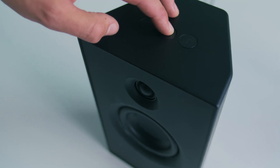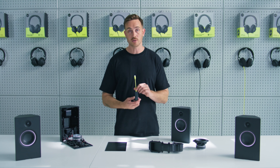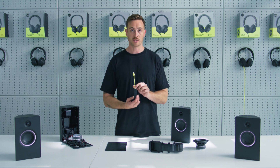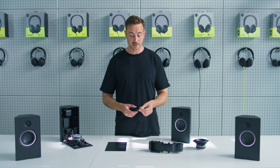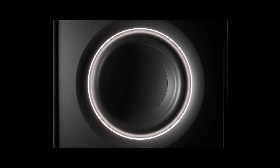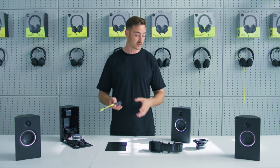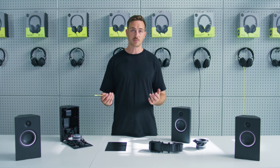To introduce Wireless Plus in a little more detail, it's our ultra low latency wireless audio link. To connect to your speaker you would use this, which we call XO2, which is our wireless transmitter. You would just connect with USB-C or AUX-in to your audio device, and this transfers wireless audio to both of your speakers at the same time with only 16 milliseconds of latency. It's designed with two antennas, which means at any time the audio stream's been sent twice, so if one of the connections drops out, you always have the other one as a backup — it's a very robust connection and you don't really get audio dropouts at all. The additional bandwidth allows us to transmit 44kHz 16-bit audio.